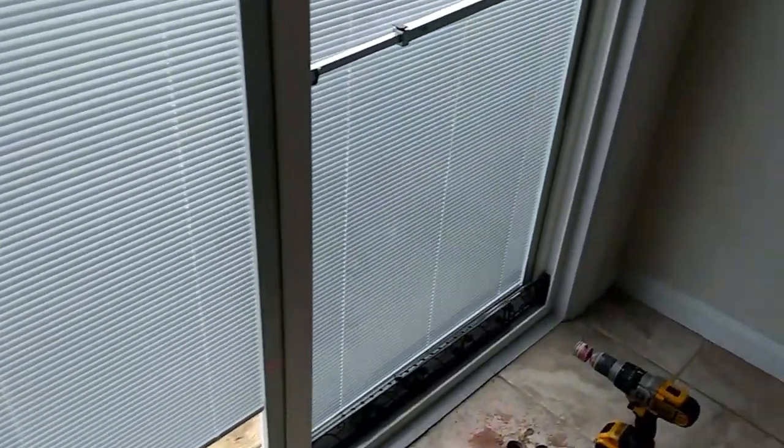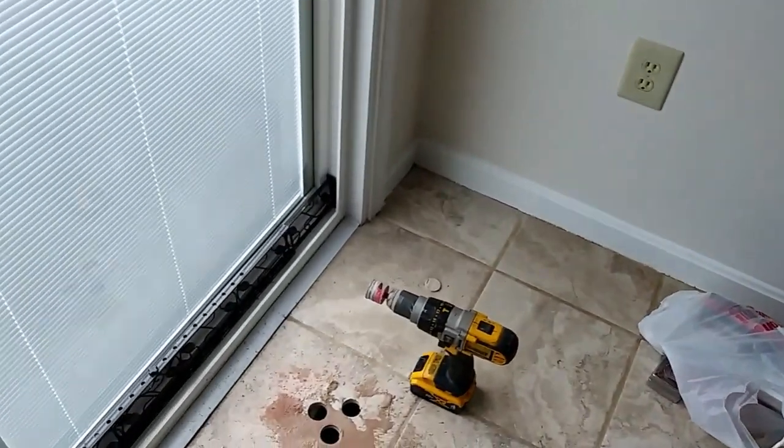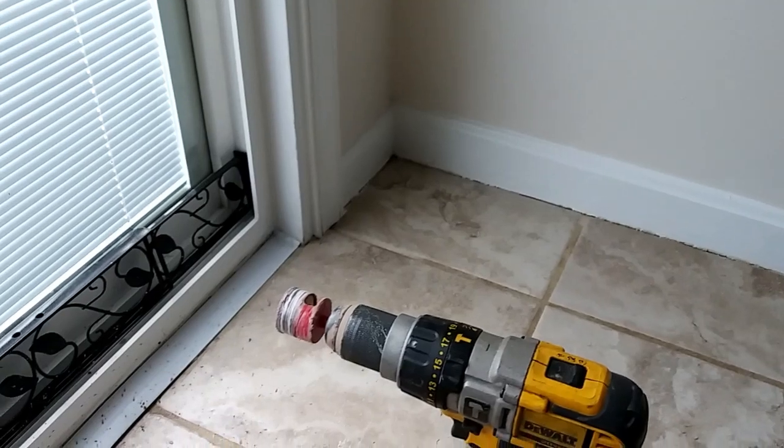Let's go back up here and I'll show you what I did. Well, first I measured it out from down below, and then from the wall to the center of that diffuser boot. But you got to add 4 inches for the wall, so 4 to 4 1/4 inches. So you got 3.5 inch studs, and then the drywall. So it was about 2 feet, and I added in the 4 inches.